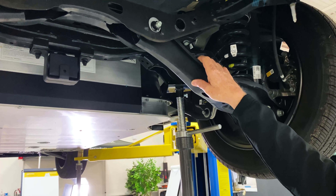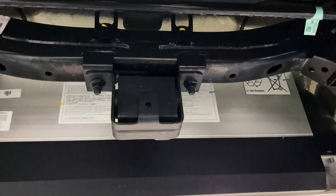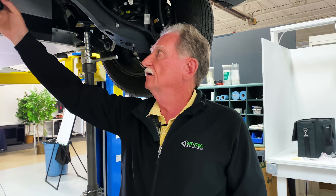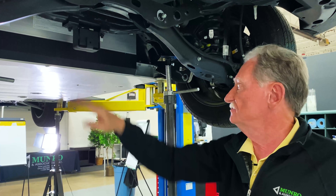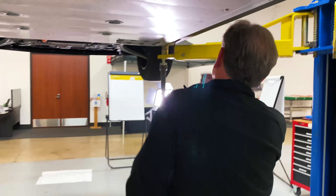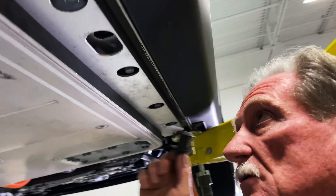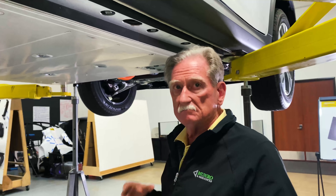Just back here a little bit — this is called a damper. Basically it's a lump of material that you put in place where you've experienced vibrations, and in order to get rid of those vibrations, you put a damper on. It's kind of like things didn't go exactly the way the engineer wanted, so there's a little something there. Also, these little doodads right here are covering up a hole. This would be my diamond hole, and on the opposite side I've got a perfect round hole — that's my pin hole. That's for lining things up so that when I put the battery in place, everything stays in place.